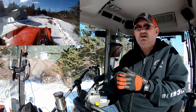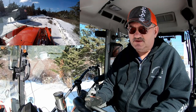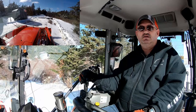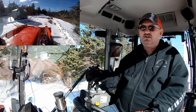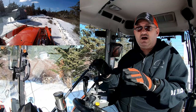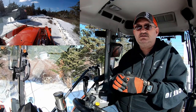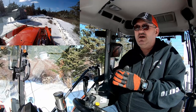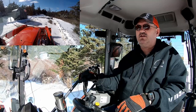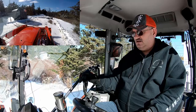The second question was how do you steer it with the blade? Well, I certainly don't use float mode. What I use is just put it down until it just barely touches the ground, because the idea here is to keep as much weight on those front tires as possible. If I put it in float mode, the front end comes up — we don't want that. We want to keep the weight on the front wheels; it gives us better steering control while we're turning.